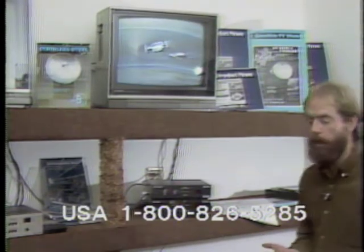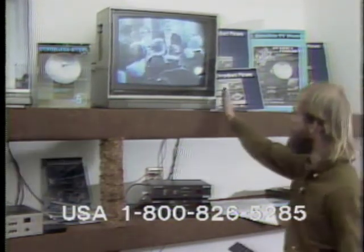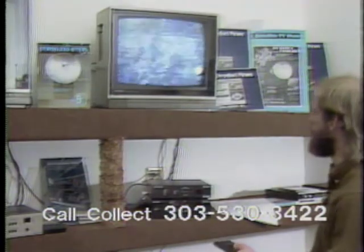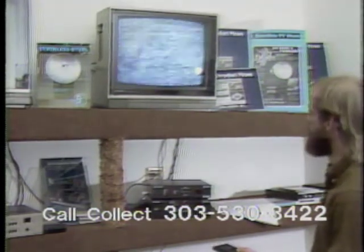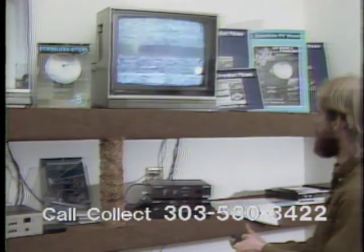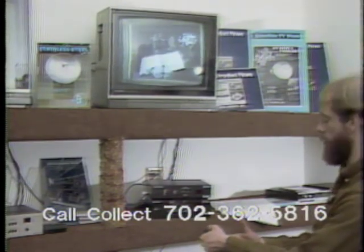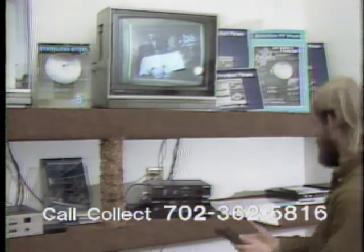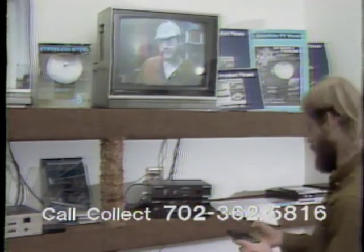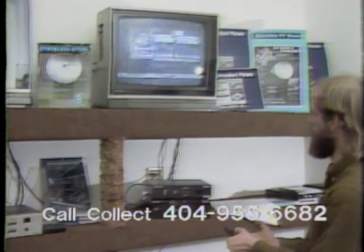I then dial up the odd channel that I have predetermined, which is 11. I do not have 11 displayed here, so I must fine-tune my polarity until I do have MTV displayed. Once I have adjusted the polarity on an odd channel for its best position, I choose an even channel, which I've already determined that I would use, channel 4, because it's easily recognized, and adjust the polarity for the best position on an even channel.